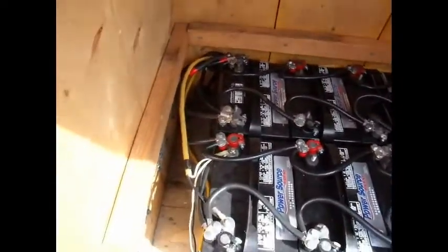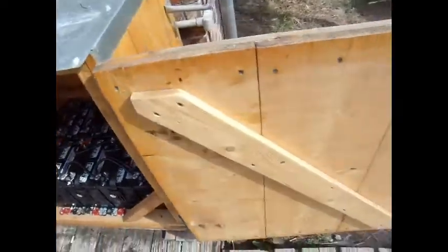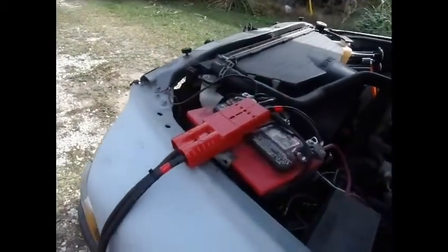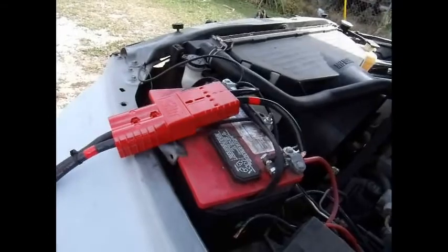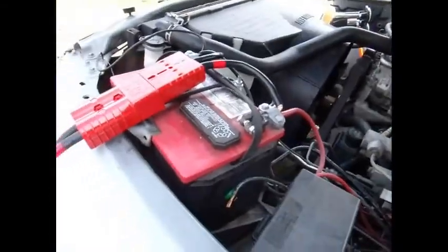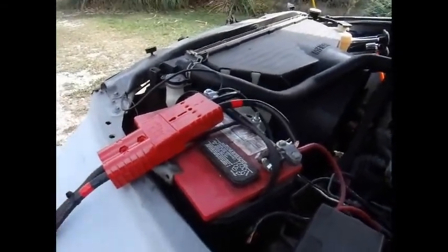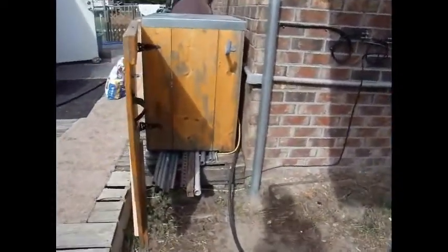I kept it paralleled at 12 volts simply because you can get power from other sources as long as you stay at that voltage. When the weather's bad, there's no sunshine, the battery's run dead, or it's dark at night, you've got a fail-safe — it goes to my pickup truck. You just crank it up and the alternator charges the battery bank just like charging a car. Keep the truck full of gas anyway, so that's like buying a generator. You don't need to buy one when you have a solar generator; you can run it as a vehicle and use it as a gas generator as well.